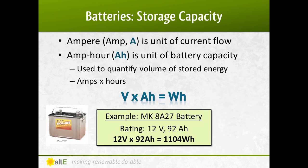Just as watts equals volts times amps, watt-hours equals volts times amp-hours. This will come in handy when we resize our battery bank later. Many people ask how long they can run things from a battery. This depends on how deeply you discharge your battery, known as depth of discharge, and how quickly you are drawing current out of the battery. If you are drawing 2 amps for 4 hours, this is using 8 amp-hours. You don't want to use more than half of the stored power in your battery, so the most power you want to take out of a 92 amp-hour battery is 46 amp-hours. So if you are running that same 2 amps for 23 hours, you would have drained the 92 amp-hour battery to 50% depth of discharge, which is the most you want to use.